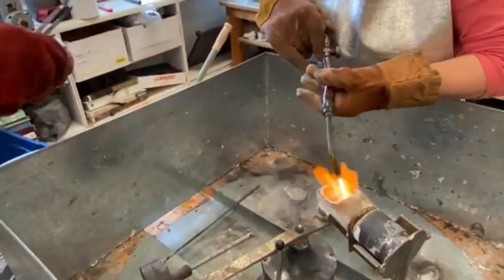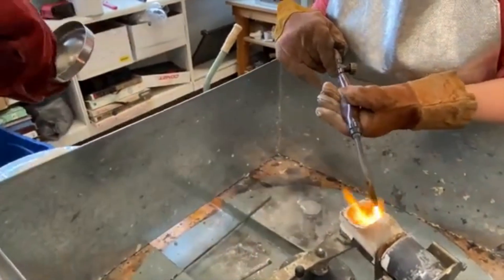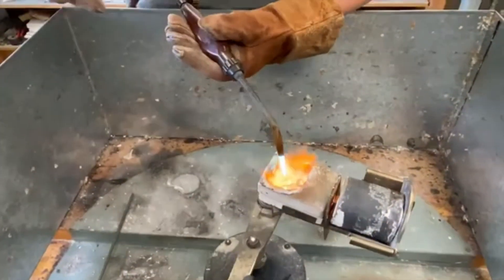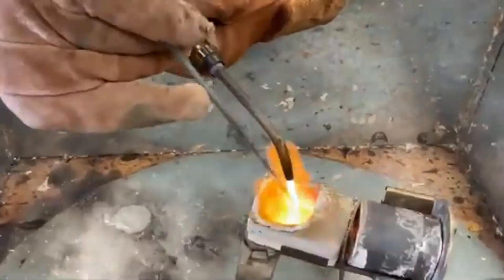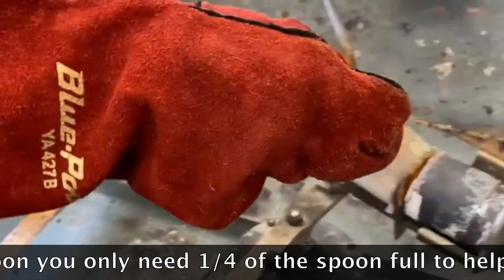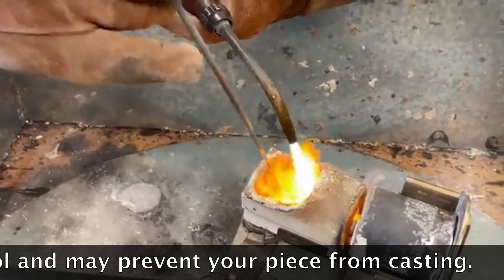You don't have to worry about rushing — just work as carefully and quickly as you can. I'm going to dump the last little bits all in, then check with my rod to make sure everything is completely liquid. Now the student is going to take a tiny bit of borax — about this much — and add it. What the borax does is take any impurities or dirt out of the metal so your cast actually works. This looks really clean to me.